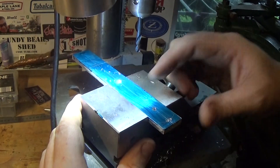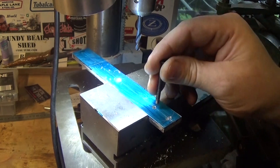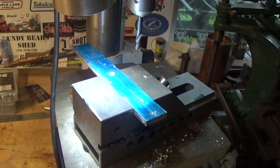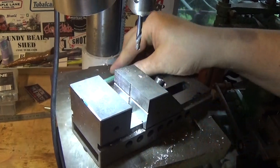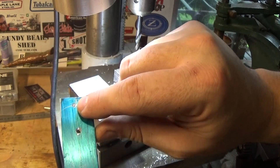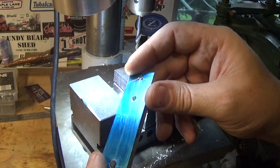So there we go, I've got those holes drilled. This one's about 5.9 for a 6mm bolt — that's a pretty good fit, I don't think it wants to be any wobblier than that, that should run nice. And this one is about 4mm — that's a good fit there too, I'm pretty pleased with that. There's a burr on the back; if we take that out we'll have a look. What I'm probably going to use is this as the actual port face — this side rather than this side — because one of these is countersunk where I used a drill that was a fraction too big. So these are nice on the other side. I'm going to give these a clean up with a piece of emery tape on a file, just take all the burrs off.